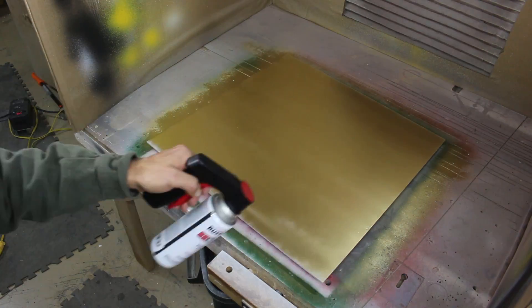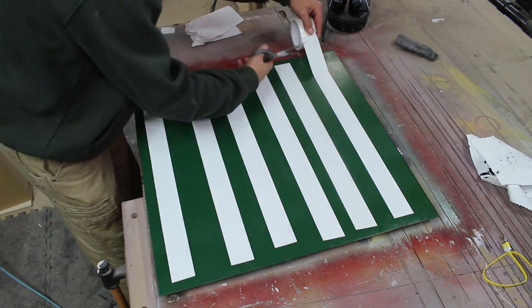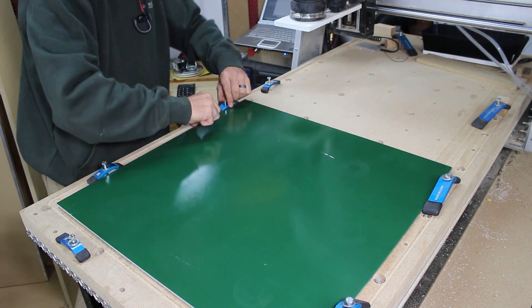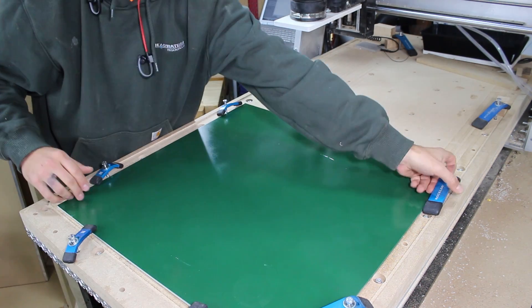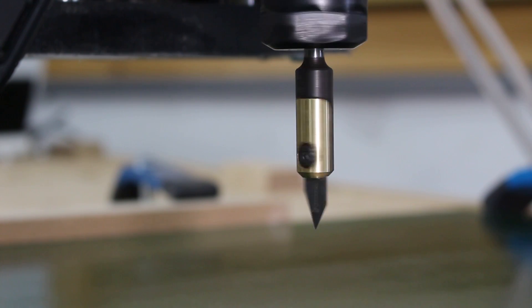To keep the parts from being damaged as they are cut away from the sheet, I'm using double sided tape to keep them in place. I load the section of aluminum on my CNC bed and hold it down with aluminum clamps. To engrave the names into the snowflakes, we will be using an Amana tool number RCK-380 with a feed rate of 5 inches per minute, 24,000 RPMs, and a step down of 1/32nd of an inch.